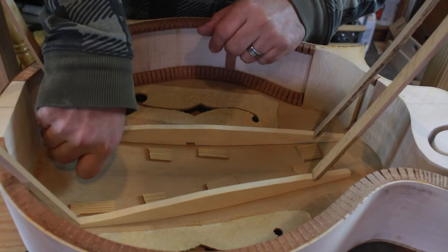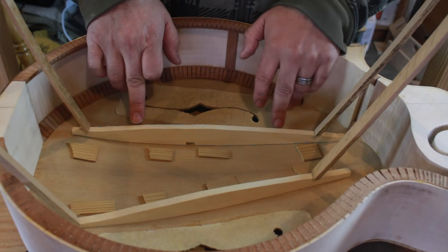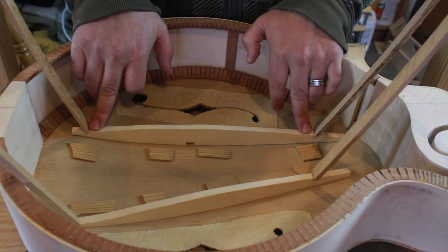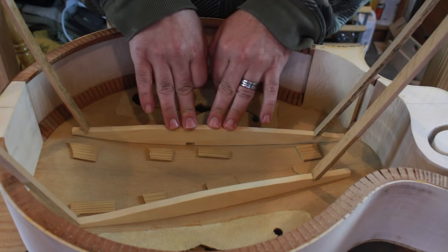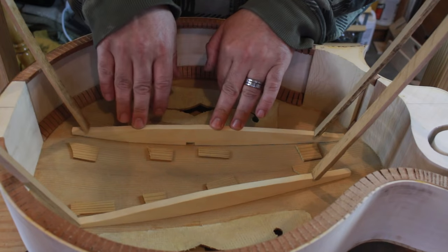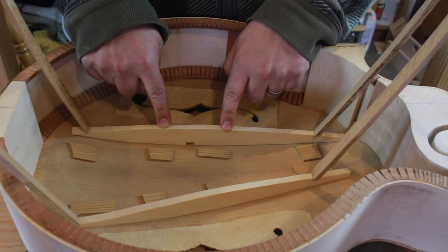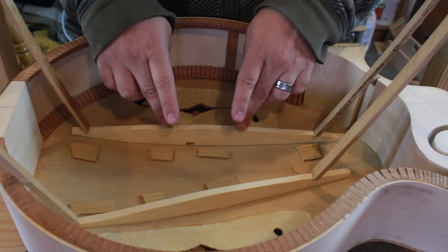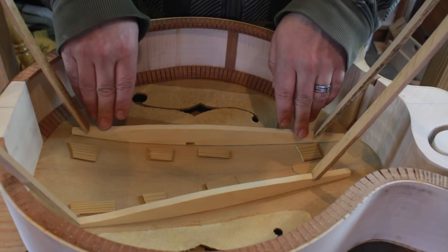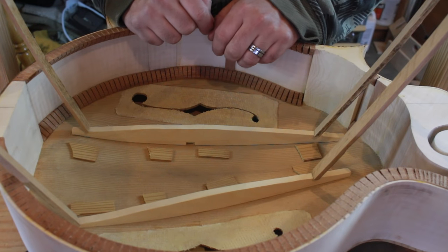So I've got those little pieces of wood where I'm gonna move my bars, and I've tapered the ends. The reason for that is they become more flexible at the ends, so I'll be able to get the center all the way down, and I made sure with my feeler gauge that there was no gap. But at the same time, once I put extra bars in here, after the glue's applied and those two are back on it, I'll be able to add more pressure, and that way, with the tapers here, I'll make sure it's gonna allow it to flex and have a proper glue up.